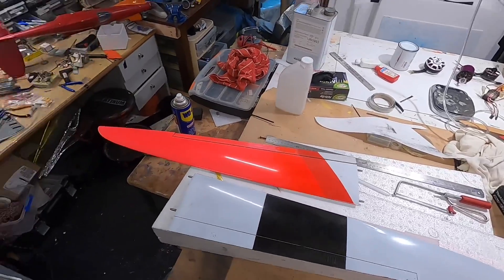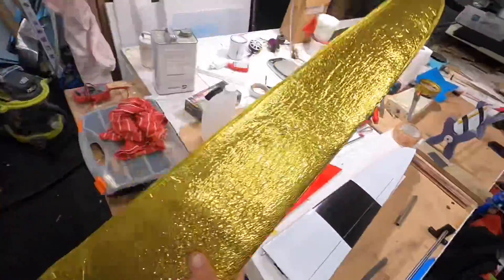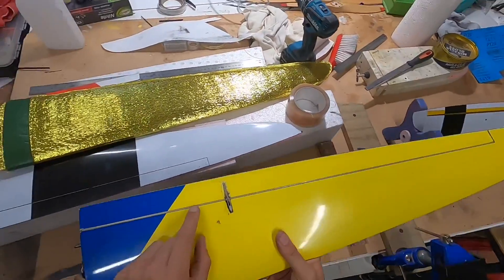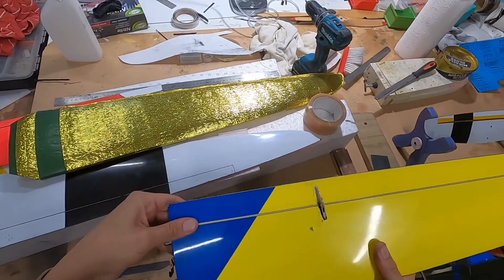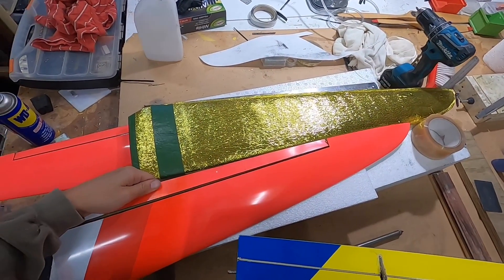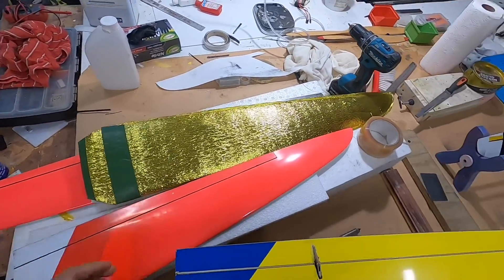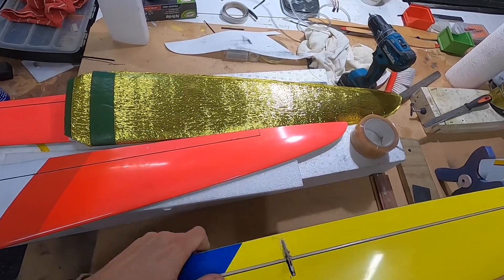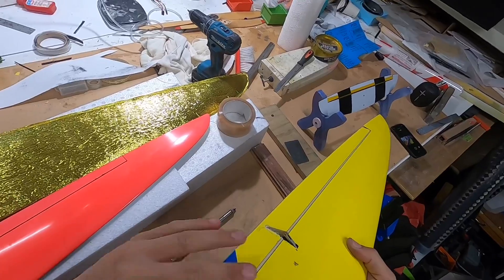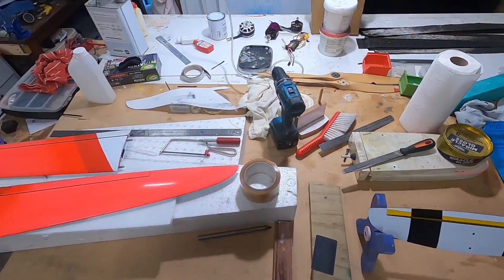When I say wipers — if we look at a wing here — when you have a wing, you have a gap created when you cut out the control surface. When you open up that control surface it creates a gap which creates an eddy and large amounts of drag and whistling noises. What we want to do is seal that gap with a wiper, which covers that gap and stops that eddy and drag. You'll notice it's quite significantly quieter — I've certainly found this to be so.